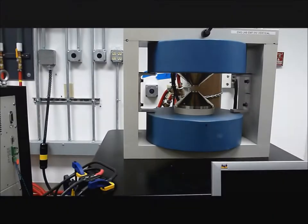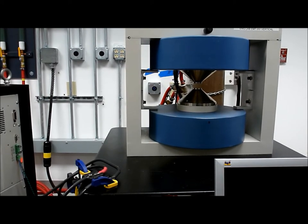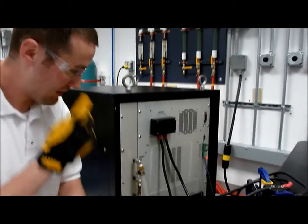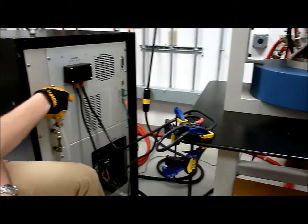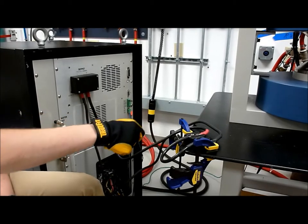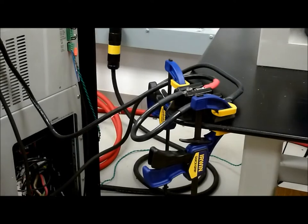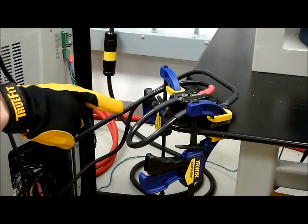For this test we've hooked the 7-inch electromagnet back to the power supply. The purpose of this test is to ensure the power supply isn't damaged if a loose connection comes into play. We've attached this terminal block here in series with the magnet leads coming out of the power supply. This gives me a controlled area to jiggle the lead and make sure that I'm at a safe distance. Right now the unit is outputting 135 amps DC into the 7-inch magnet, and the intent is to ensure the power supply isn't damaged by jiggling the magnet leads.